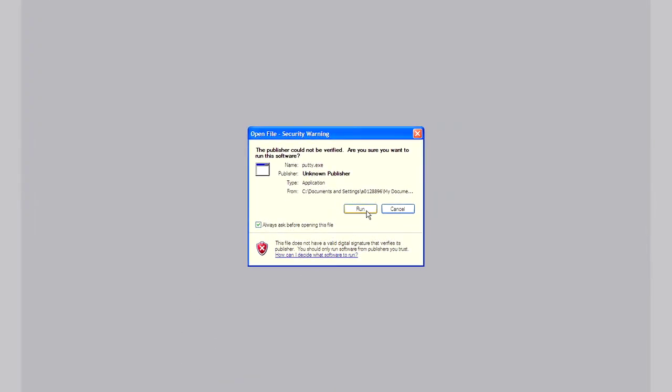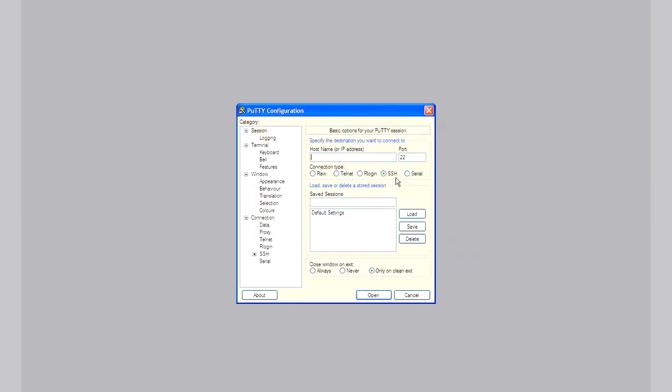Double-click on PuTTY.exe on your desktop. Make the settings shown in step 34 and then click Open. Your COM port number will be the one that you noted earlier. So here we're going to use COM34, a speed of 115,200, and the settings are 8, 1, none, and none.